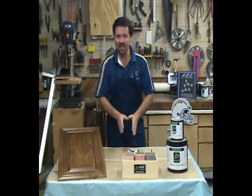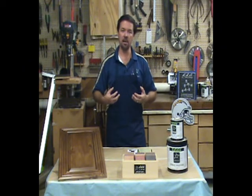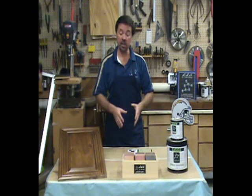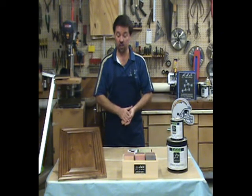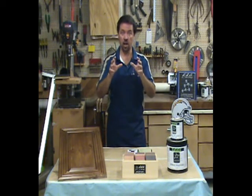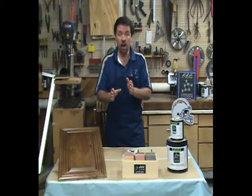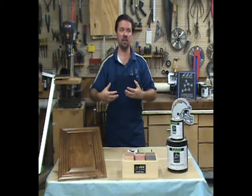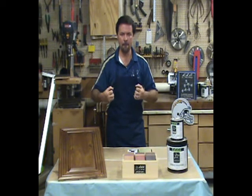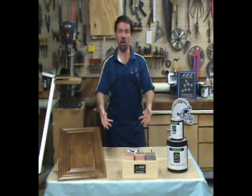Now, on that subject, a big concern with water-based is it's very anemic looking. It doesn't make the wood grain pop out. We have combated that in all of our coatings, some of them more than others. Take Brushmaster, for example. You put that on a piece of oak, that grain jumps and pops out to you. It's not a toned product, it's still crystal clear, but through chemistry it's able to make that grain stand out and make it look like a big, deep, rich color, not just an anemic piece of cellophane put over the surface like most water-based and waterborne products are.